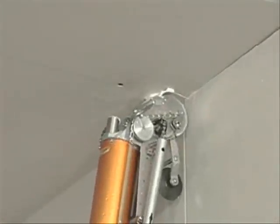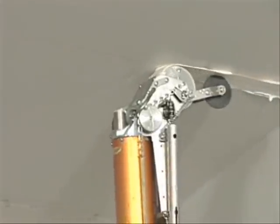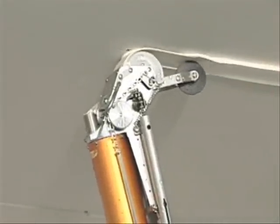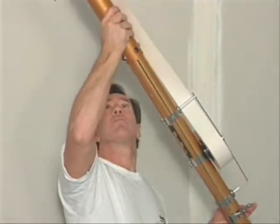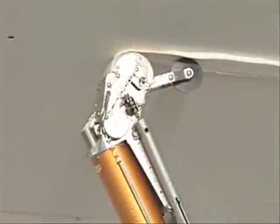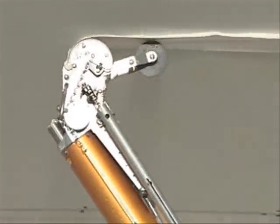The procedure is similar for ceilings. Use both drive wheels on the joint for the first 6 inches. Then, engage the creaser wheel and tilt the bottom of the taper at a slight angle, leaving only one drive wheel in contact with the drywall surface. The creaser wheel will stick the tape firmly in place until you wipe it down.